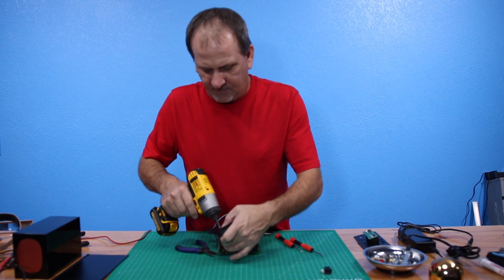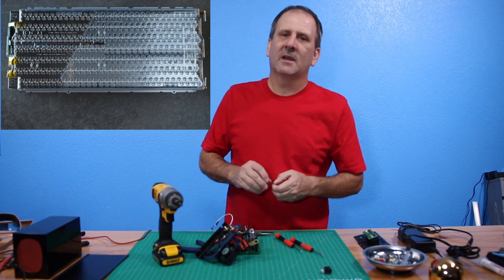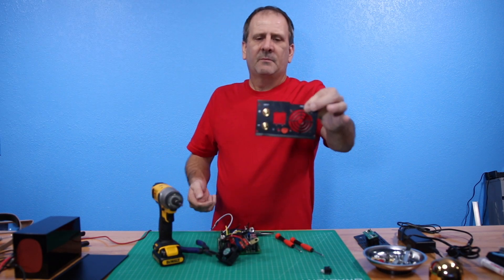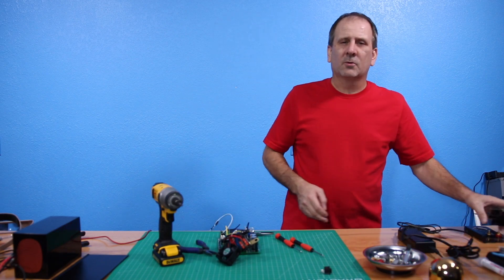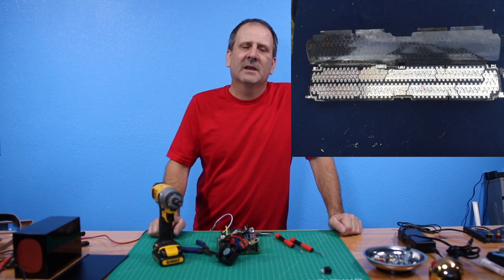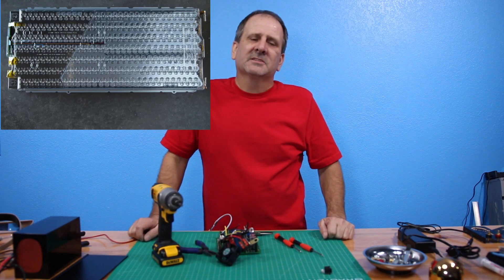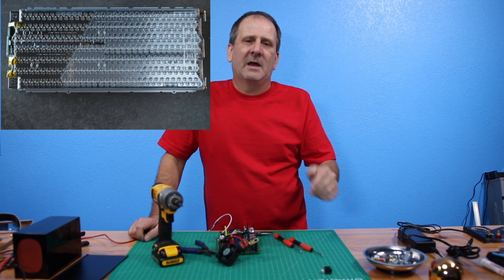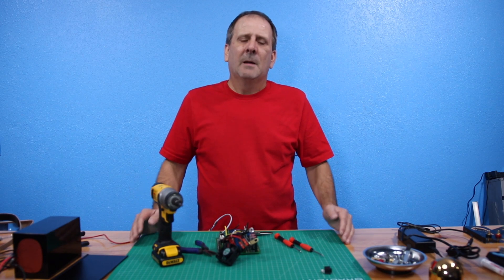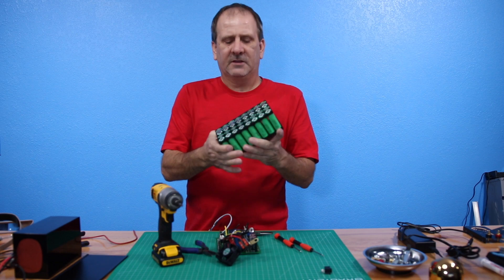I've been slam busy — I got some pretty exciting news. I just ordered a ton of Tesla battery modules — I ordered a bunch of the Tesla S modules and they should be coming this week. I also ordered six of the Tesla Smart ForTwo car batteries, so I got a whole pack. When that gets in I've got to tear that down and pull all those battery packs out. Those are like 3.5 kilowatt batteries at around 55 volts. The Tesla S modules are the Panasonic 18650 cells fused both positive and negative on each side — about 23 inches long, 11 inches wide, and 3 inches tall — basically a bunch of 18650s in a much nicer configuration built by a robot.